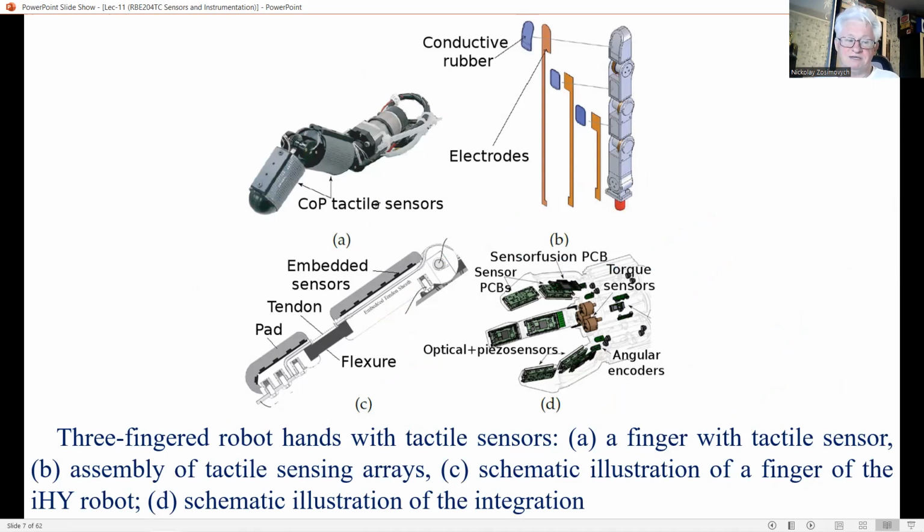A particular kind of force sensor is a tactile sensor, mainly encountered in robotic applications. Tactile sensors of the cutaneous type consist of an array or matrix of elementary pressure or displacement sensors. Many optical techniques have been developed to obtain information on the displacement of the individual elements or texels. Four major methods are variable transmission, variable contact area, total internal reflection, and pressure-sensitive optical fibers. A common problem is the resolution. In order to realize high resolution, the texels should have small dimensions and be densely packed.